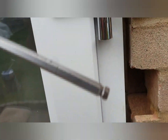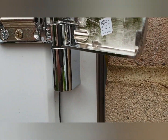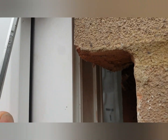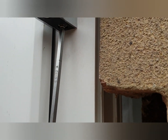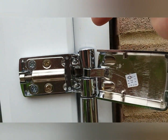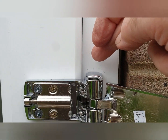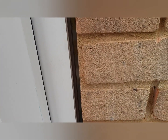Underneath here on the main hinge, you've got two screws — ignore one and go to the one at the rear right. It's a five mil Allen key, and if you adjust that clockwise, that raises the door upwards. So if it's hitting on the bottom, you need to raise it up.